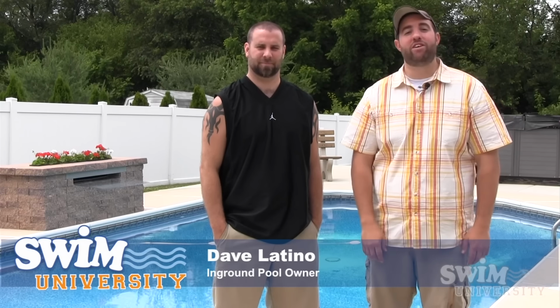How you doing? And we are going to change the sand in his sand filter today. Now, I guess it's been, what, 6 years since? 6 years. Yeah, since we've changed the sand in the sand filter, and over time, the sand loses its coarseness, so it doesn't filter as good. So, are you ready to change the sand? Let's do it. Let's change some freaking sand.